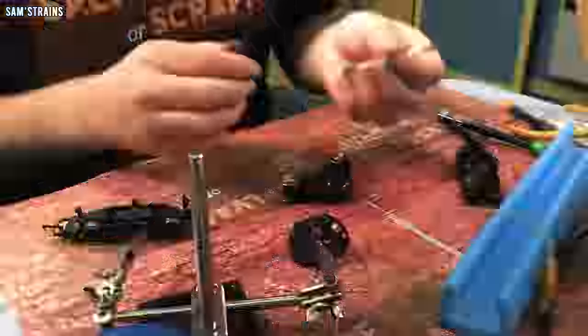With time running short, I'm going to have to improvise. The chassis itself can't be soldered to, so if I find a screw that fits into the chassis, I can solder the wire to that screw and make a new connection. Oh, this is the worst thing to have happen right now. This is a disaster. I had not planned to do this anyway.